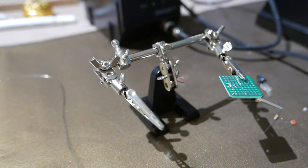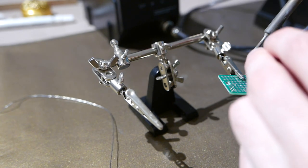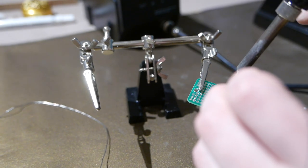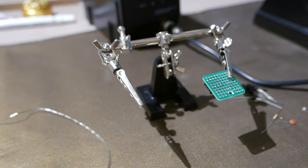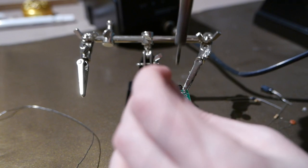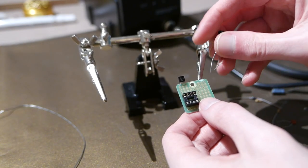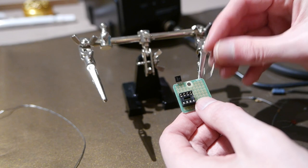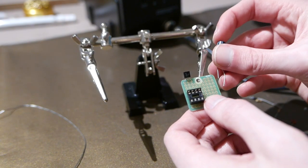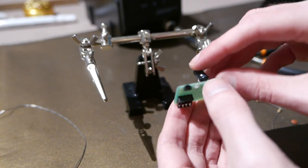Let's get wiring. My usual camera stand is broken so I'm going to use a normal tripod. Here I'm connecting the breakout adapter for the ATtiny. Next I'll connect the NPN transistor. I'll put power on the side with ground out to one side and voltage on the inside. That means I'll put a capacitor through from the other way around, leaving a little space so I can bend it down if needed.